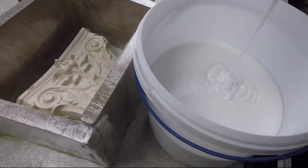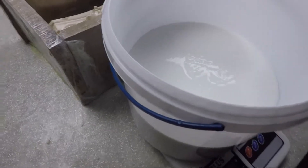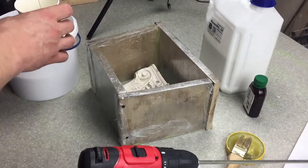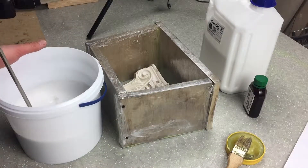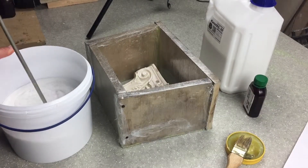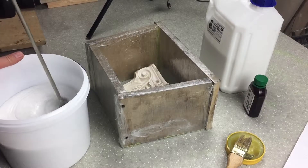Any plastic glass of a suitable size can be used as a formwork — in this case, it is not necessary to cut the bottom. If you make a formwork from a sheet of cardboard or thick paper, as in our case with the cup, you need to fill the edges with a soap base or liquid nails to fix it. If the formwork is large, laminate chipboard around the master model attached with screws and seal. After the base has frozen, the formwork is fixed, and it is necessary to install the model itself.